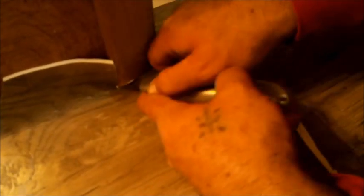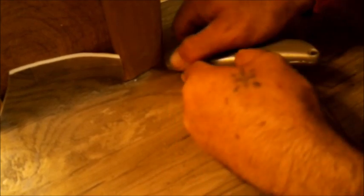Like I say, most important, notice when he cuts that, he holds his blade on the side and cuts it up so he can tuck all that under. That's what makes it look good. Right, Chris? Yep. That's the part that looks good. And then we're quarter rounding this all the way around. Chris, let me get out of your way.